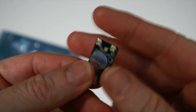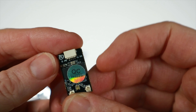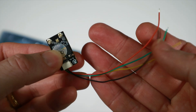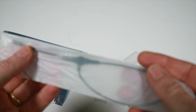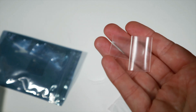Some things are smaller and bigger than you'd imagine. So here's the receiver itself, which is a diversity receiver — I think it's got two of the chips on there. We've got a cable to hook it in, and I like the fact there's a connector on it — makes things a little bit easier. And we've got two antennas. I did ask if these were suitable for both 868 and 915 and they said yes. I don't know if that means tuned to the middle or tuned to one and will sort of work on the other — the range will be reduced but this is pretty long range anyway. And we've got a couple of heat shrinks ready to go.